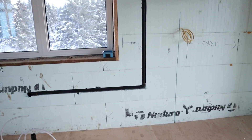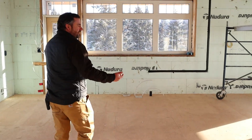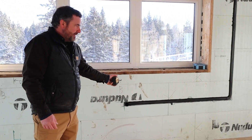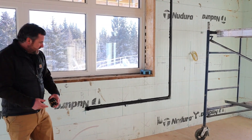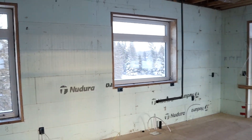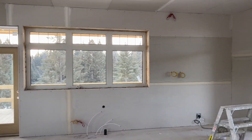Over here you'll see some venting. Plumbing is something people always ask about. We have a sink here on an exterior wall — that's our vent, and that's common. You would never run a drain or water lines in an exterior wall anyway. So here's the drain, and our water lines come up through the floor. That's really the most plumbing you'll typically see in an ICF build — it's not a big deal.